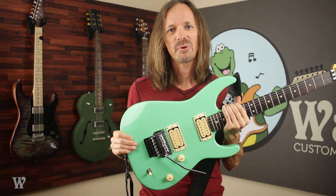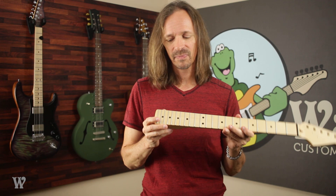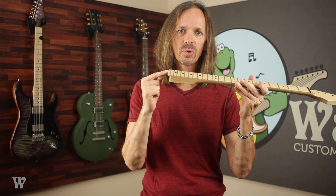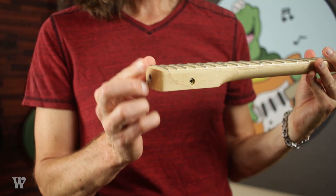There is one thing I think we can all agree on when it comes to the 720 mod: you should never ever get it on a body with a pickguard. The reason why is because as you tighten the neck down into that neck pocket, you haven't left enough clearance for the overhang to clear the top of the guitar — you are going to hear a sickening crack, and that sickening crack will be the sound of you splitting the fretboard off of your neck. Now, you could in theory get a 720 mod on a body with a pickguard if you plan to use a 21-fret neck that doesn't have an overhang.